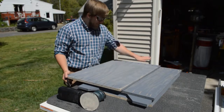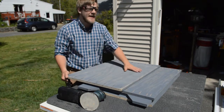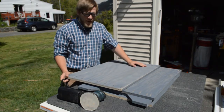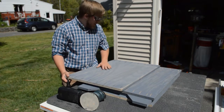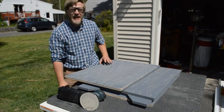Morning YouTube. So this is the day after priming of the dresser. What we're going to do is sand down everything and prepare it for its final coat. I'm going to start coating it with a latex white paint using an air sprayer. The other thing I'm going to check for is any other nicks or dings that I had missed.